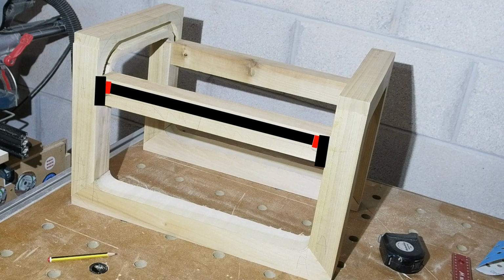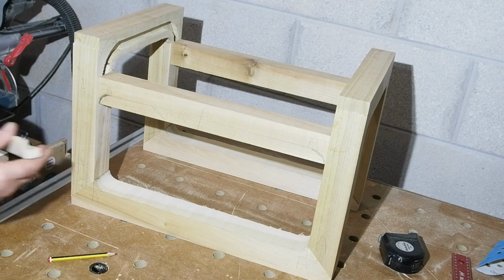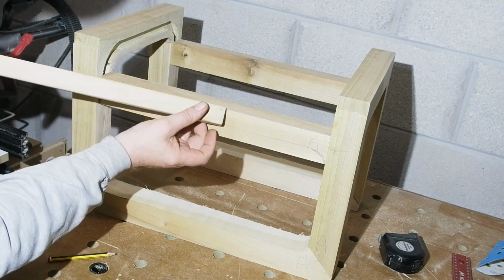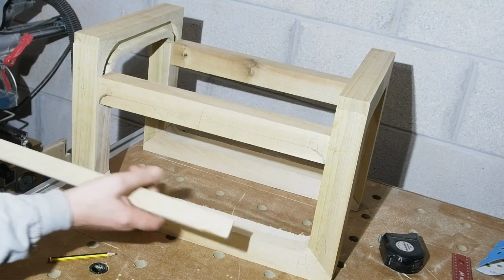As I've sort of been forced to do here by my own lack of foresight, I'll be blending into a face. This will of course give me the look I'm after, so I can assess whether I prefer the straight butt or the curved blend, but the glue line may wander as I remove material to make it look and feel just so. So here's the original piece that was originally meant to be fit, by the way. The same as on the chair, straight butt into the leg face. Once whittled away, my new one will be dimensionally the same, except at the ends.